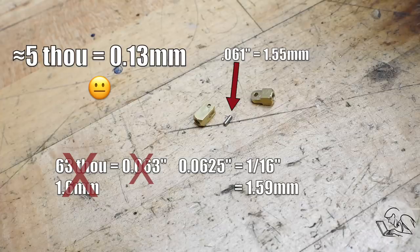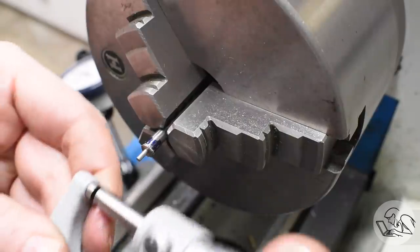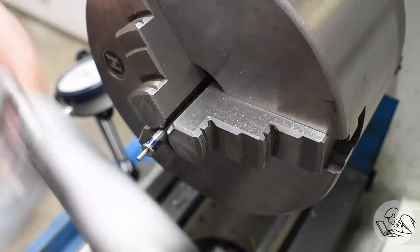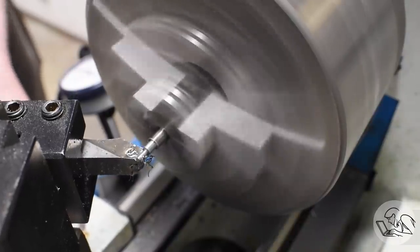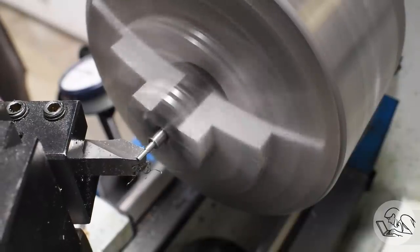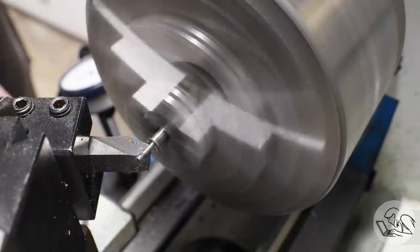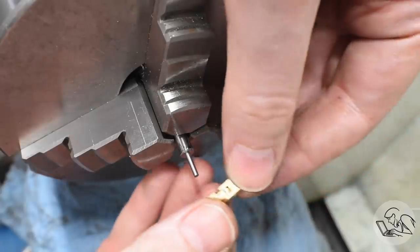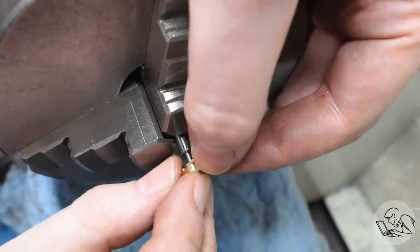I'm not happy about that, so I'm going to make my own pin. I've got a piece of O1 tool steel drill rod and I'm going to turn it down to that teeny tiny pin, making it a little oversized to fit my slightly oversized hole. Turning something this small is a little tricky, but here's a way to do it: I turn about half the length of the pin to a few thou oversize, then come back and turn the second half. By doing it this way, you always have most of the material supported. If you tried to do the whole pin in one go, it would be much too thin and you wouldn't have enough rigidity for the machining forces. By doing it in sections, working your way back, you can get a very long, thin part — leaving each section a couple of thou large, then doing a very light finishing pass down the whole thing for one consistent diameter. Then I polish it up. That's a much better fit. It's still a slip fit, but it's not all loose and sloppy.